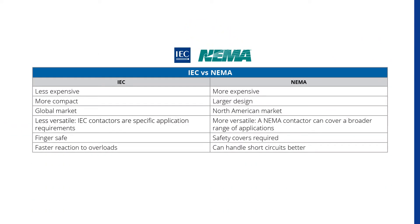IEC, or the International Electro-Technical Commission, is a global standard. IEC contactors are not oversized. They are smaller than NEMA contactors and less expensive. The range of sizes offered by manufacturers is more numerous than the 10 NEMA standards. As such, they are more specific to a given application and are specified when operating conditions are well understood. NEMA may be chosen when operating conditions such as the load are not well defined. IEC contactors are also finger safe, whereas NEMA requires safety covers on contactor terminals.